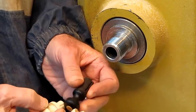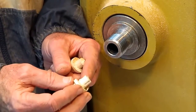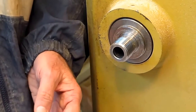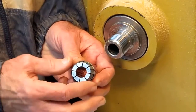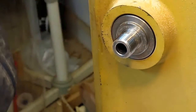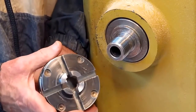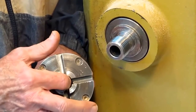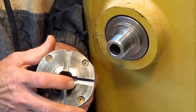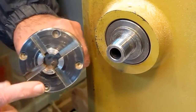You can see the deforming you get when you use a Jacobs chuck or a three-jaw chuck — it'll actually crush the tenon a little bit. When you use a collet chuck, you get just about a hundred percent grip on that tenon, so it's very, very tight. I find it's a much more secure grip than the chuck I've been using for small items — my 25-millimeter bowl jaws, which have about the same range of motion and clamping size as the Nova pin jaws, but they're not quite as long, so they don't have quite the holding power. The collet chuck holds better when you've got a longer piece with some leverage on it.